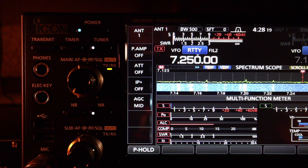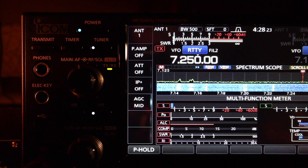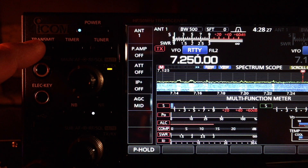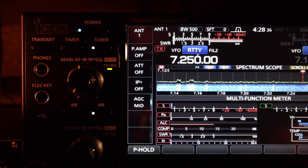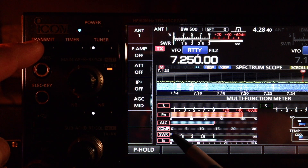Near the upper portion of the 40 meter sideband, no antenna tuner — SWR is about 1.7. Again I can utilize the built-in antenna tuner to bring down the SWRs.